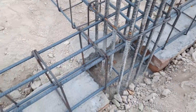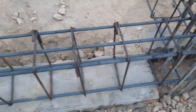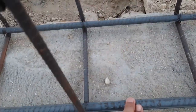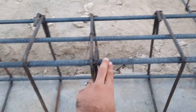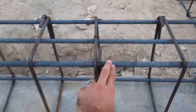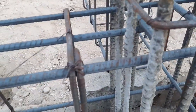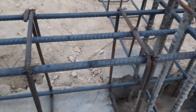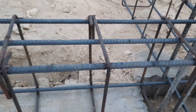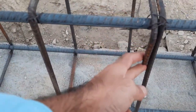The third mistake: you can see the spacing of stirrups with hooks. We have two steel rods of 12mm diameter at the bottom and three bars of 12mm diameter in the upper portion. The spacing of the stirrups is excessive here — it should be at a distance of L/4, about 8 to 9 inches at the ends.